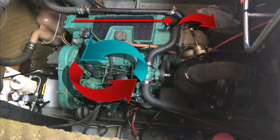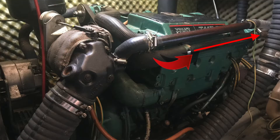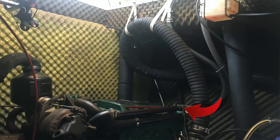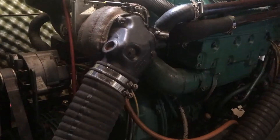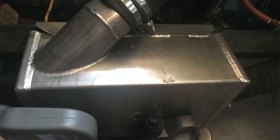The sea water is then passed through more tubes taking the heat from the engine with it. It then passes through more pipes up and over an anti-siphon system and back into the exhaust elbow where it mixes with the exhaust gases and cools them down too. Finally it enters the muffler where it helps to cool down and dampen the sounds of the engine.